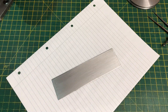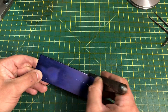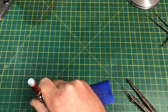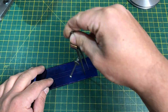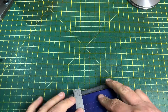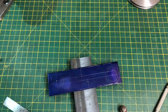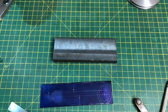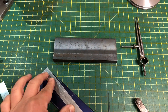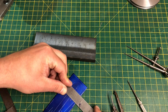I have cleaned the sheet with some isopropyl alcohol, and just straightened the long edges with a file to give me something to work from. The two fingers are identical in shape, and I am marking them out at the same time from opposite edges. Now I will often roughly mark out parts before transferring them to the mill, but in this case the entire shape will be completed with handwork alone, so I am being quite careful with the dimensions. The hole positions are centre punched, moving them if necessary until they fall on the scribe lines, to provide a positive location for the dividers. One of the fingers has an additional hole to take a clamp, and a quick sanity check of the dimensions with a rule completes this layout.